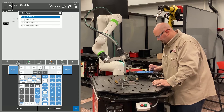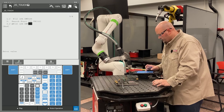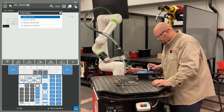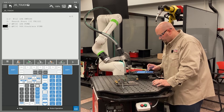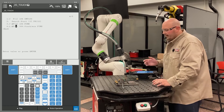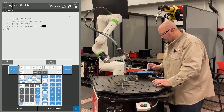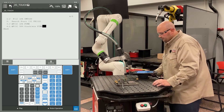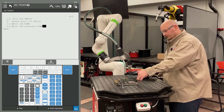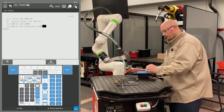I'm going to record a point in space as a J motion with a fine termination. I'm going to record another point in space as a linear motion with a fine termination. I'm going to change the position ID numbers to match so they're the exact same location in space. Line 3, the first position ID 2 is the robot getting to the search location. Line 4, the second position 2 is the robot searching from that location.